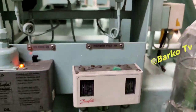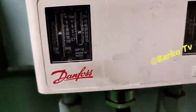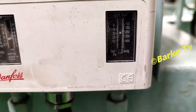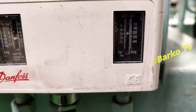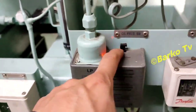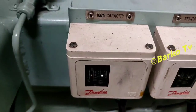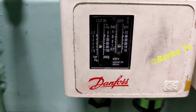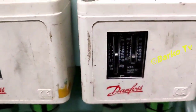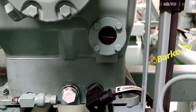Our pressure on the high side is 18 bars. This is the set point for our low suction, and this is the default set point for our high discharge pressure. This is the oil pressure — for 100% capacity, it cuts in at six bars; for the 67% second stage, it's four bars. This is the crankcase heater below the side glass.